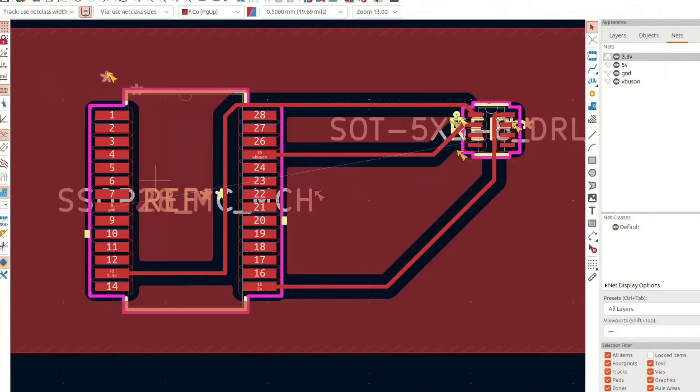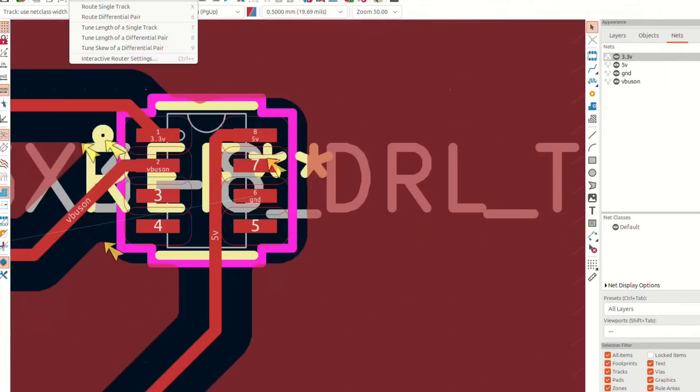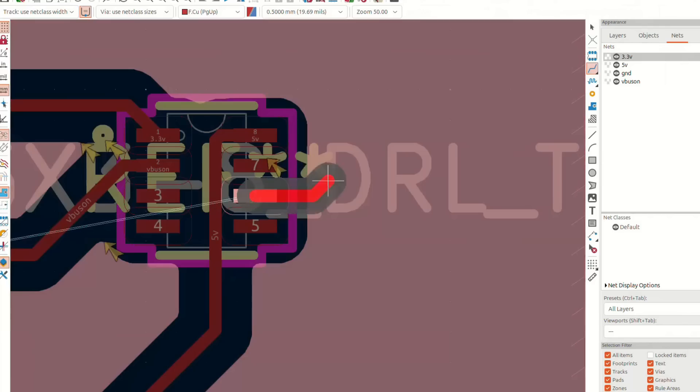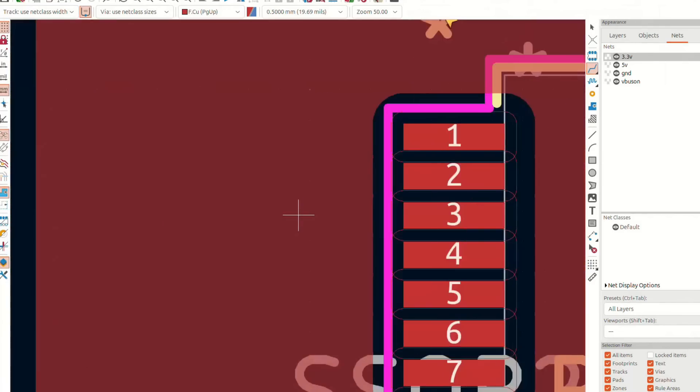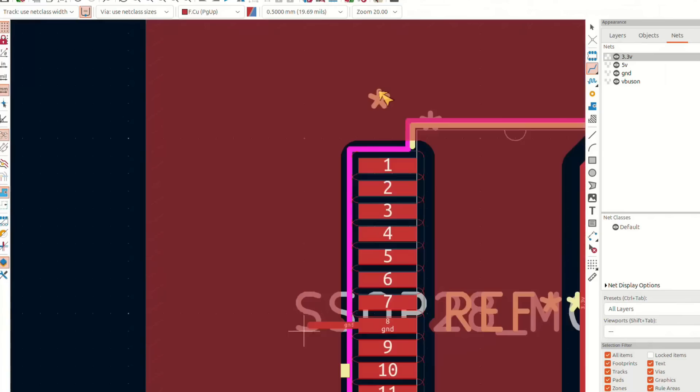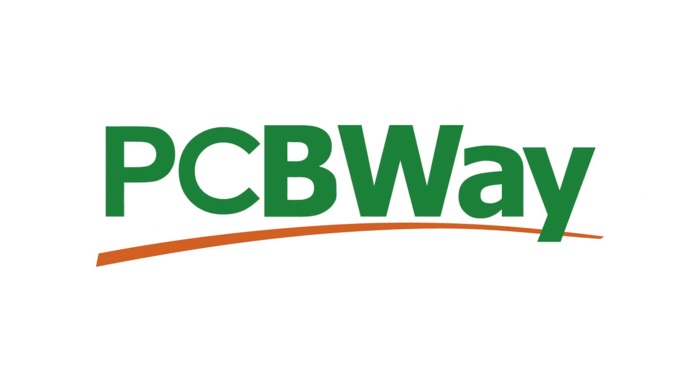The reason you want to do this with ground is that having a large ground plane around all your parts helps reduce noise, and also serves as a really helpful heatsink. Parts that get really hot have a pad connecting to ground that helps dissipate heat through the circuit board. After you think it's all done and connections verified, you can export the project to a Gerber file and then use this video's sponsor, PCBWay, to turn it into a physical product.